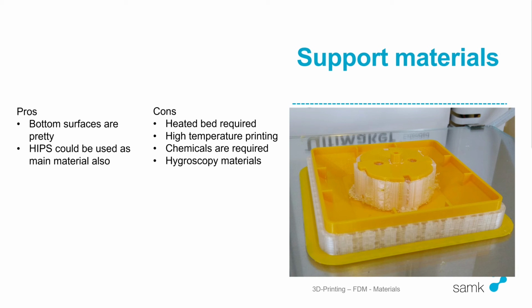If you take it out of the box and start the print with it, the print will come out fine. And if you leave the printer there and don't do anything with it, still the material, the PVA in the machine, and then you come back a week later and try the same print, you will notice that it fails miserably. And you try it again, and it fails again. It's an endless cycle.